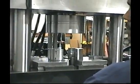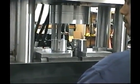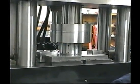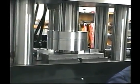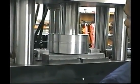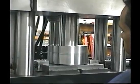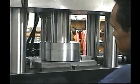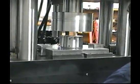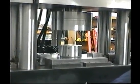We're going to do a dry run without any part. So go ahead and start. Now the top clamp is coming down. This is the donut that surrounds. Now you hear that pressure, the fill check valve holding that still. Now the top cylinder, which is internal, is forming. That pressure also, you just heard a noise that backs up. The clamp cylinder comes back up.